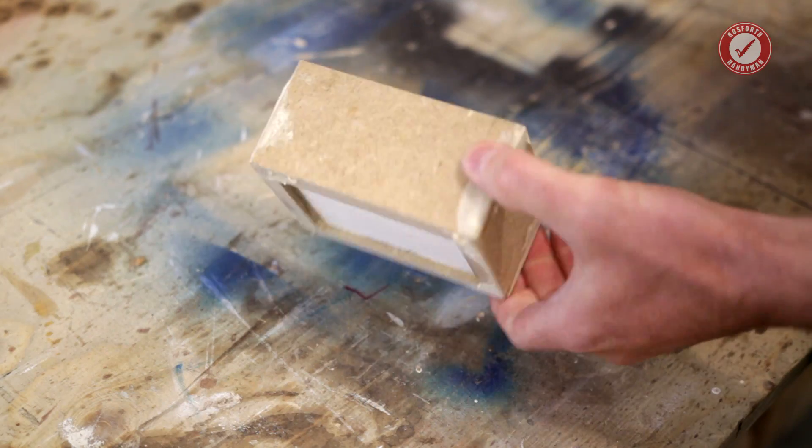So I built a little housing for the unit out of MDF — just 12mm MDF scrap I had lying around. I used mitered edges and put a little dado in to support some 6mm backing board that's going to hold the switch itself. It's all glued and brad nailed together. The glue's dried, I've put some filler in the nail holes, and we're going to pick it up from there. If you like this sort of stuff, don't forget to hit subscribe.